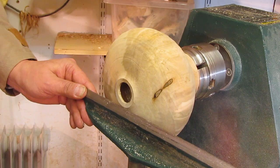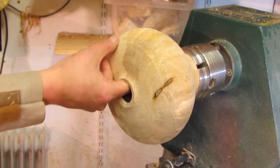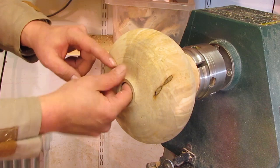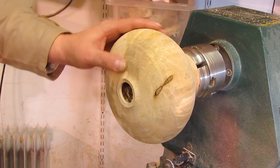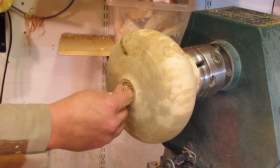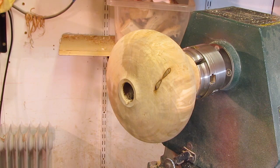I'm just going to check with my fingers down to the shoulder, and once I've got beyond the reach of my fingers I'll use a set of callipers to check the thickness all the way down. I want the wall thickness approximately 10 millimetres all the way down, equal. If you're out a few millimetres it's not going to make a huge difference, but we want to get in the habit of making it as precise as we can. I'll remove the shavings and then remove the rest of the wood from the inside, then talk about how I'm going to sort out the knots on the form.